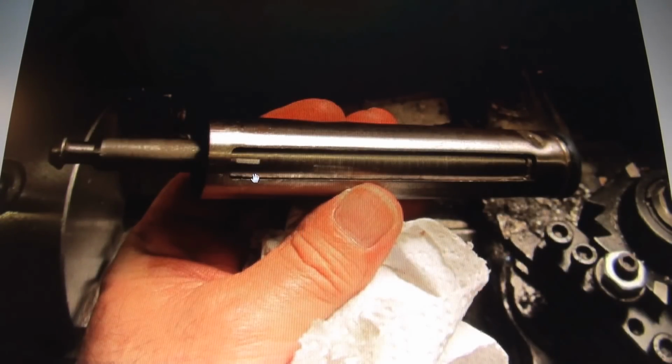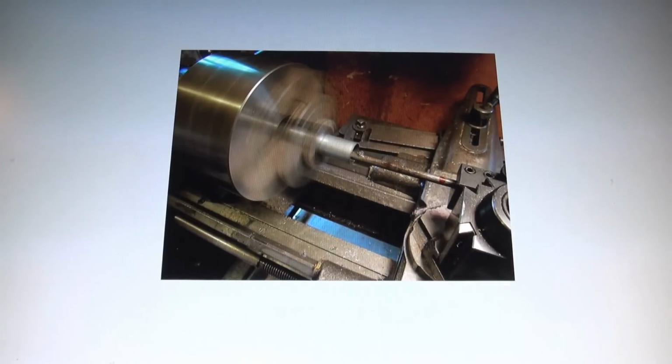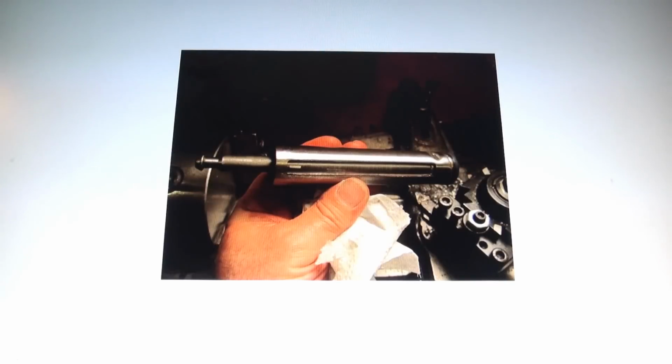And the only thing I have to do now is make a washer for the inside. I actually had one on the bench, but the washer was not proper. It fit, but it wasn't proper. So this will just be taken out and fine sanded down. I also fine sanded, let's see, where are we? I fine sanded inside the tube after it was all done with, what was it, 320 grit, then 400. Anyway, that's the only problem.